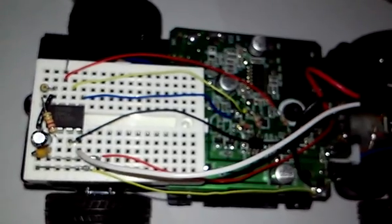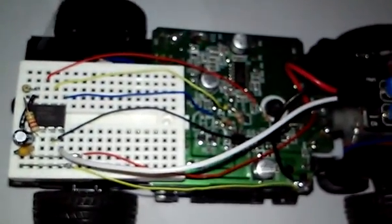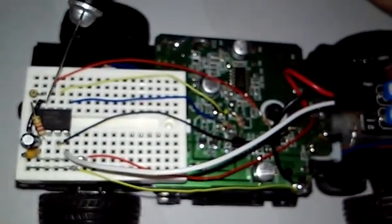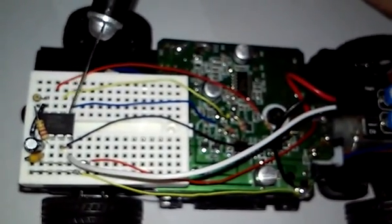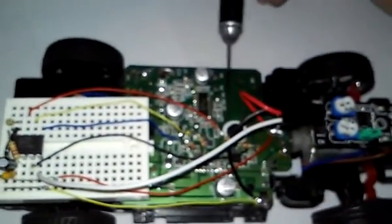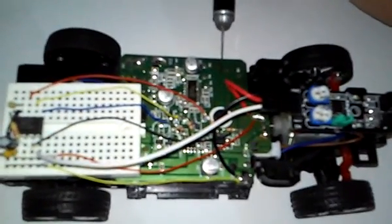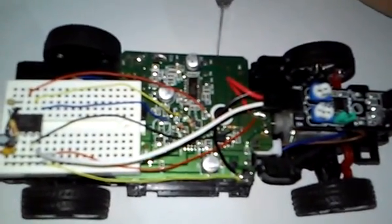The download PC USB plugs into the breadboard right over here. So four wires — four outputs on pins C0, C1, C2, and C4 — drive the H-bridges, plus power connections. We're using the three AA batteries which power the car to power everything: the car, the PICaxe, as well as our front sensor.